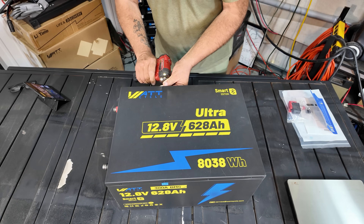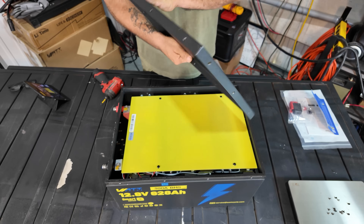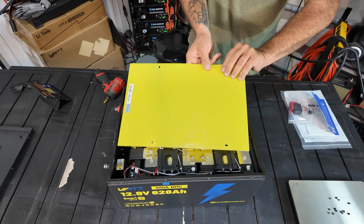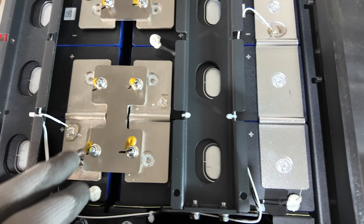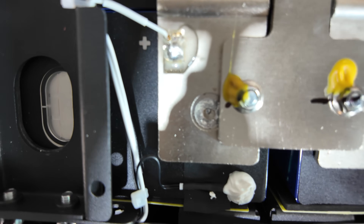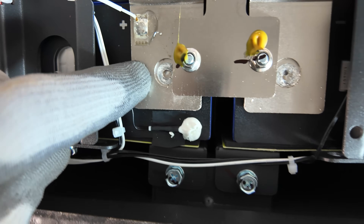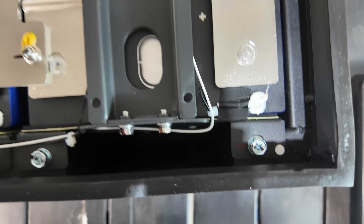Let's open it up and take a look inside. Pulling the lid off — man, look at that. It's pretty much like their 314 amp hour 24-volt battery: a really heavy metal case, built really well. Taking the fiberboard off, first impressions — I see a lot of similarities with the 314 amp hour battery, but there are some differences. One thing that strikes me right away is the balance leads are soldered onto the bus bars. I'm not really a big fan of that — the 314 amp hour had ring terminals screwed onto the bus bars — but they seem to have some kind of epoxy hard coating over it, which should help hold it better. You've got nice thick bus bars with expansion between them, and the wire management looks good as usual.